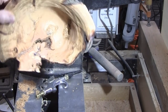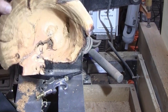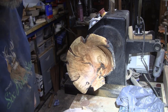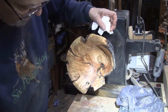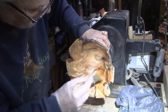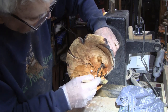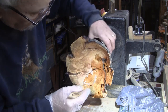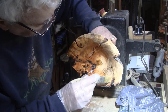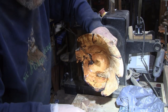I spent over three hours using my two-inch disc and hand sanding this. I think I got it pretty good. So I'm going to go ahead and brush this sanding sealer in because I have so many cracks. I'll keep a little paper towel to catch any drips. I want to get a coat on here and then probably sand it again from 240 if it needs it. Let's see how much tearout I might have, but it's actually looking pretty good.